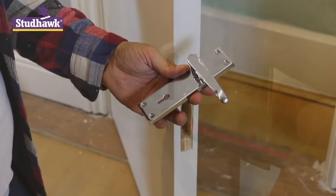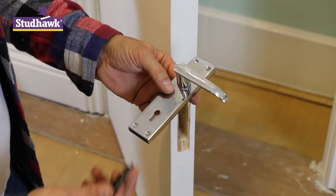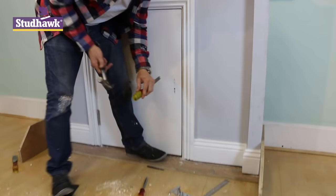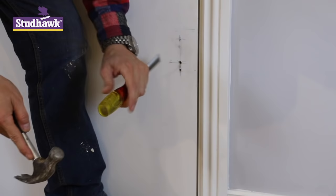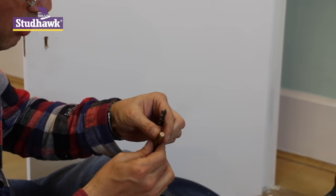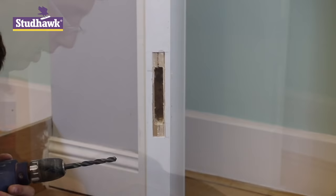Check our horizontal centre of the keyhole. Centre of keyhole. Here's our handset and I've selected two drill bits — one for the size of the keyhole and one for the slot at the bottom. Now we'll do the other side. Select the drill bit size to fit the spindle; otherwise it will get stuck on the edges.